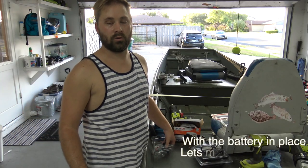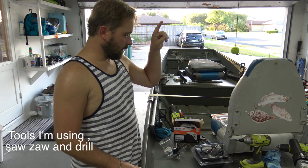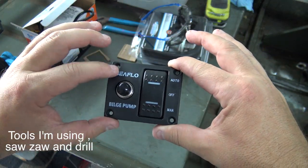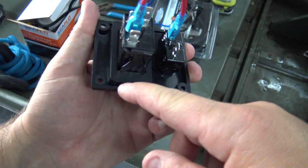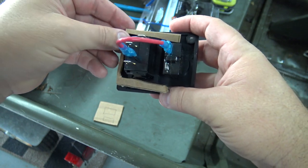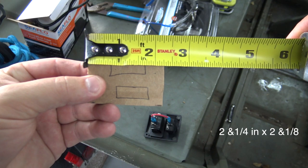So this next part — what I'm going to do is actually drill into the seat of the boat. This is aluminum. I'm going to use a combination of my sawzall and a hand saw to install this. If you look at this switch it comes with four screws. Look at the back of this thing. What I'm going to have to do is cut the metal so this little lid can sit on the metal. So I got some cardboard and cut this out so that I know exactly how much to cut — for reference, two and one quarter inches.